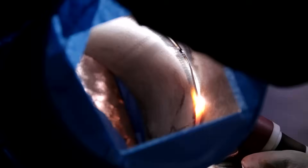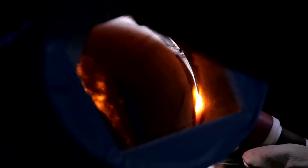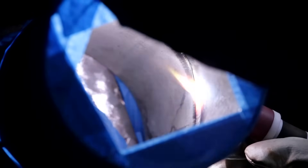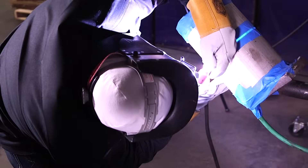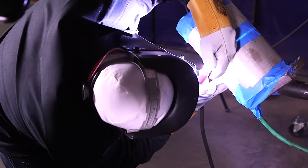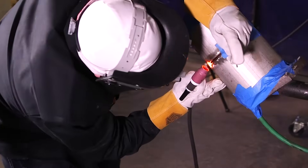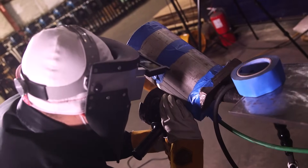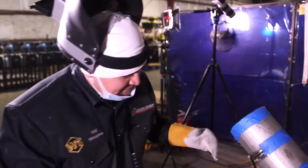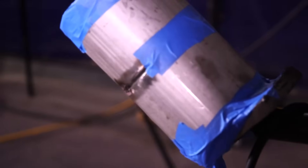What I'm going to try to do here is quarter it, because stainless does pull on you crazy — that pipe will move all day. So try to go quick but take your time. I keyhole dip, make a keyhole, fill it right back up. Keep that wire in that pipe because that wire could oxidize and throw trash into your weld. Whenever you feel uncomfortable or run out of rods, stop — don't keep going. I just feathered the tack here and what I want to make sure you do is burn out that fisheye. If you got a fisheye when you popped off, you need to get that out of there or when you tie into it, it's going to stay there and it will fail X-ray. Make sure when you grind it, look at it, make sure you got that pinhole out of there and keep on rolling.